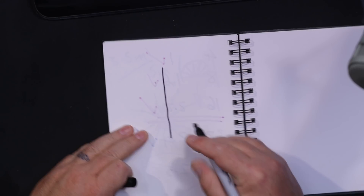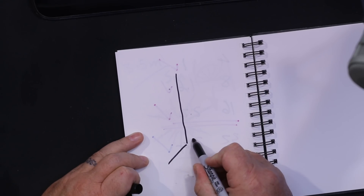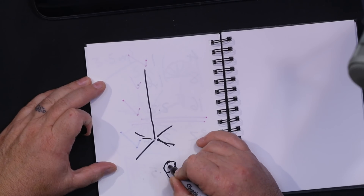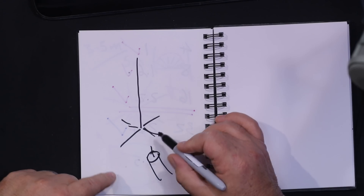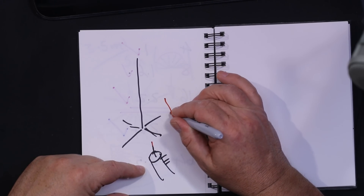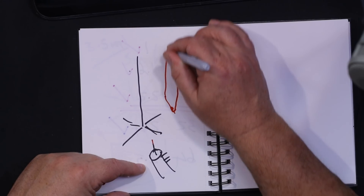I was on holiday and I took a vertical - it was a 40 meter vertical. I had some radials - I'll put a link to my radials video somewhere. The radials were on the ground, so your coax came along, the center goes straight up the pole, and the radials connected via some brass earthing blocks to the braid. I put a bit of tape or Vaseline on it and it was fine. Then, just because I'm that way inclined, I wrapped a bit of wire around and went up the other side of the pole with a 20 meter element.